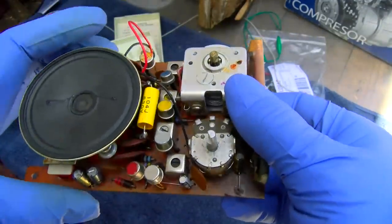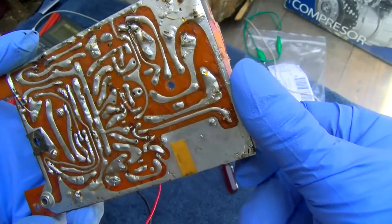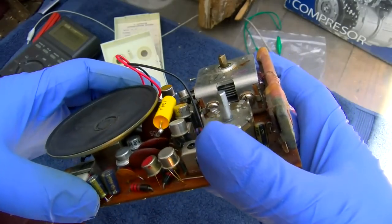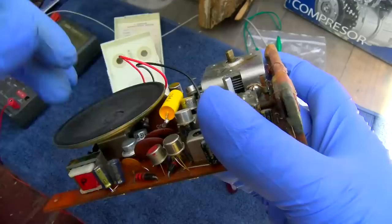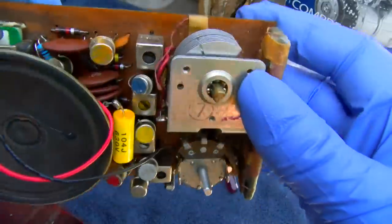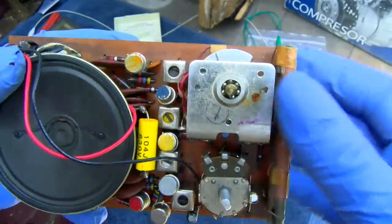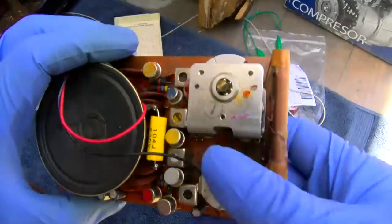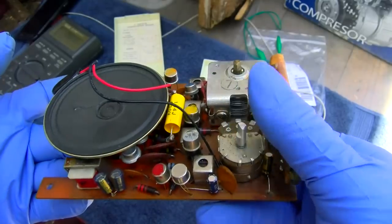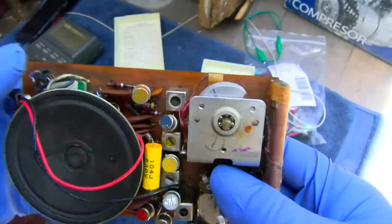This is where a schematic really comes in handy to possibly deal with years of botched repairs. It could be that this is hooked up backwards and all the capacitors are in backwards, or it could be this is all hooked up right and these are all NPN transistors. So I guess the first thing we need here is a lot of research. Do we have any numbers on these transistors? Okay, there are no intelligible numbers on any of these transistors, and Sam's did not cover this.